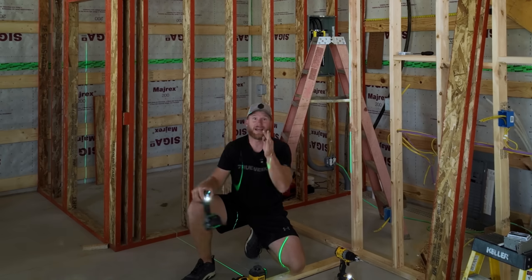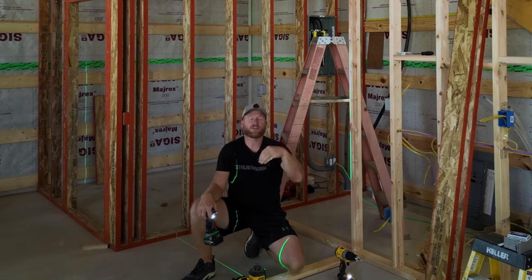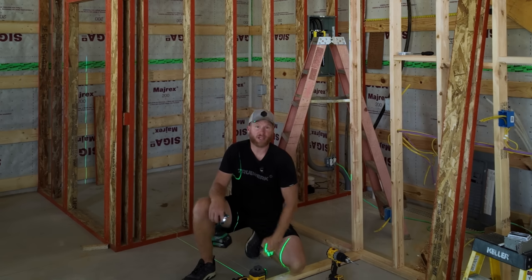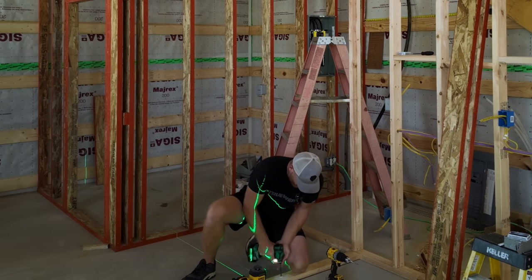Now, if you remember, when I did my radiant tubing, the tubing is locked into the bottom with the heat sheet heavy. So the foam at the bottom, which is a 5-inch thick slab, has those nodules that I put the radiant heating in. I'm not even going 5 inches deep, but that also includes the 1.5 2x. So I'm far away from hitting any of my tubing.